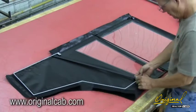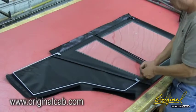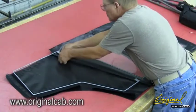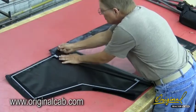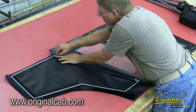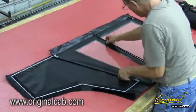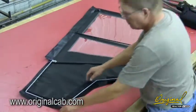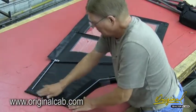Install door bottoms, see figure 3. Insert 2 1/4 by 1/2 inch bolts into the holes in the lower door frame with the heads against the vinyl. Place the door bottom over the holes, add lock nuts, and tighten. Close the snap flaps and or the Velcro strips around the rod.